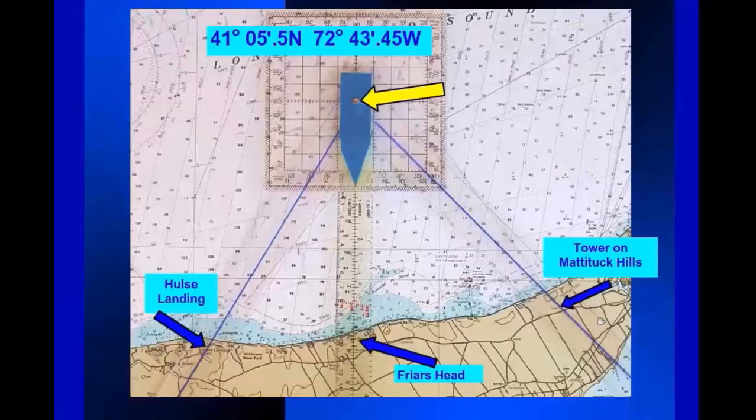The other handy use for a sextant in coastal navigation is to find the distance off a given object, such as a lighthouse high on the cliff top. As long as you can see the shore below the object, you can measure the distance off. To do this, you use the sextant vertically. Measure the angle between the light and the shore directly below.